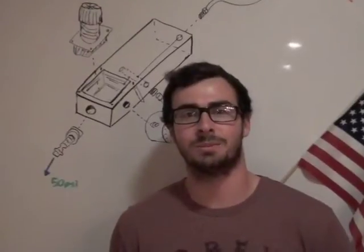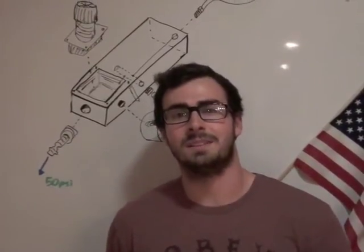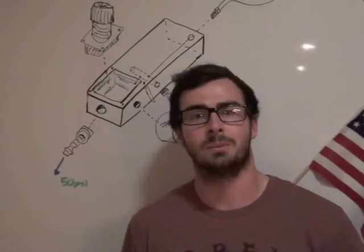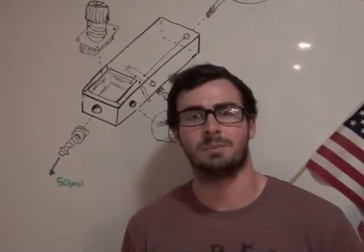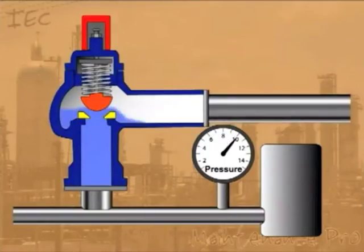Dean Wink, Junior Mechanical Engineer, designer of the OneTouch AirChuck. The original idea was to modify our benchmark by implementing a small adjustable relief valve into the manifold body. This valve would be set to a desired pressure and the tire or object would inflate until the specified pressure was reached, thus causing the relief valve to open and create an escape path for the air and curb inflation.